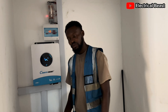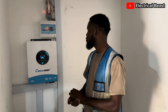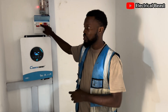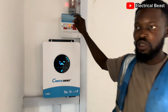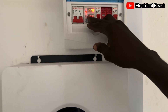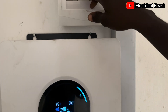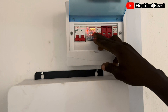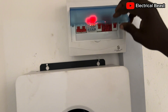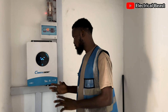This system is working fine. We also have grid charging incorporated, but the voltage protector here limits the voltage entering the inverter to charge the battery through the grid. I set the range from 180 to 220 volts, but right now the grid voltage is only 61V, so it locks and cannot charge. This protects the inverter from under-voltage or over-voltage.